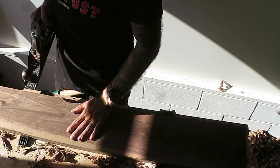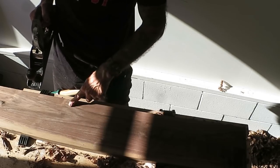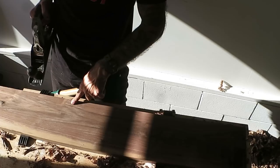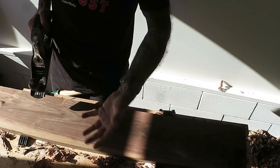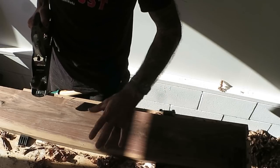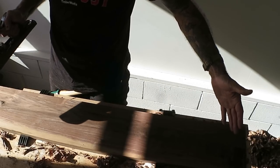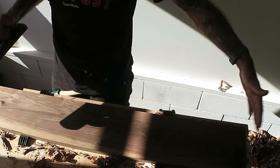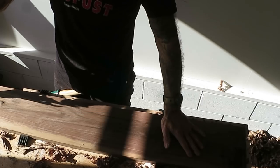So this board's actually pretty well flat. There's some tear out which I'm going to deal with as best I can now. Then I'm going to prep the other board, joint them together, glue them up. And then I can work out maybe a drawing of how big this unit's going to look and how the proportions are going to be.